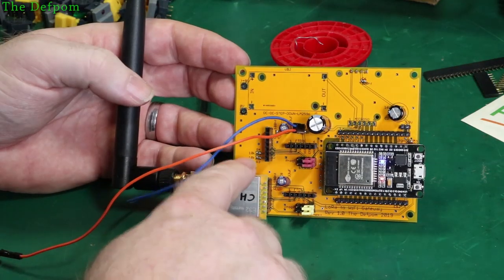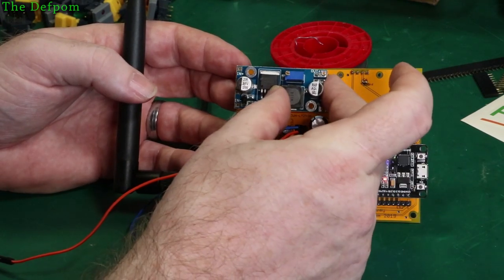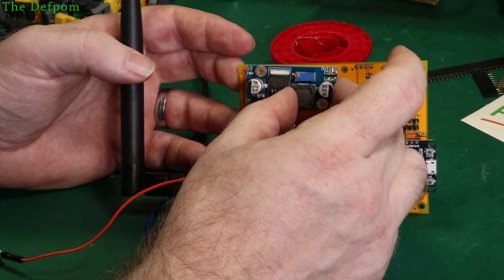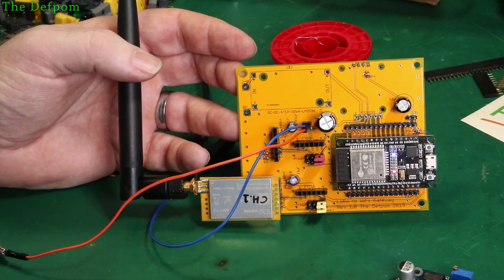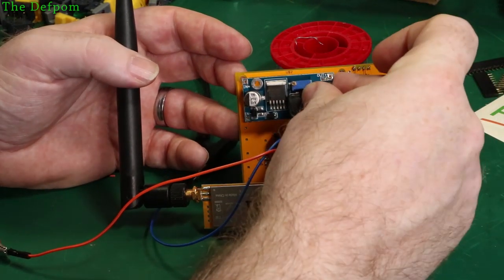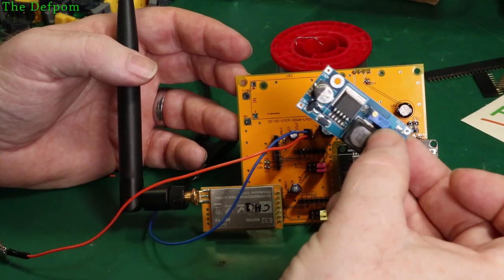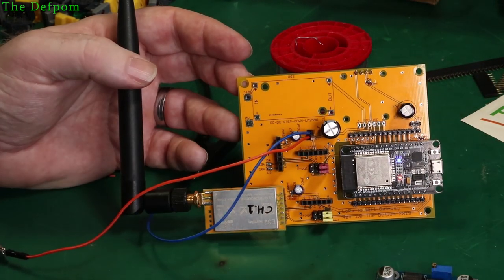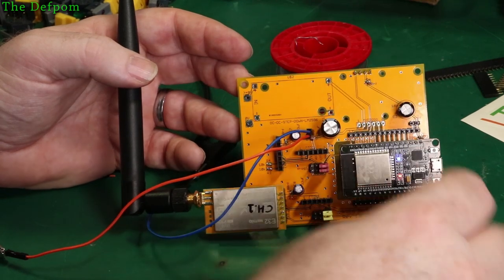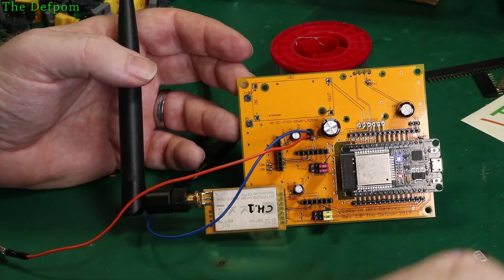That's all good. So there's a position here for a second module. It's a real shame that this power supply didn't just sit on there like it's supposed to — it was designed to just go on there. I might be able to make it fit — I can probably run some long leads like component leads, like the ones I've cut off the capacitors, through those holes and just stand it off a little bit to make it all line up. I think I'd probably be fairly happy with that actually. I won't be able to get both mounting holes lined up, only one of them, but I think with my own mounting hole and the four wires it should be fine. It's not that heavy a module and it's a fairly static device, so I'm not too worried about vibration affecting it.